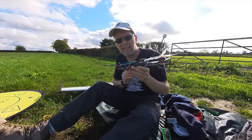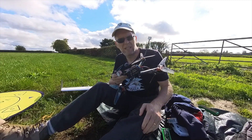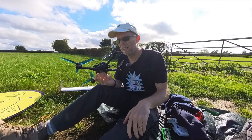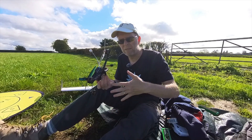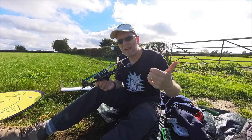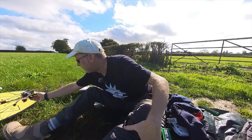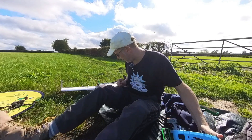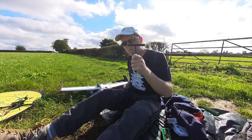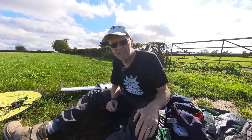This is a little 7-inch quad that I recently put the AKK 5W VTX on. I flew it about a kilometre and a half, but then I had some really bad ELRS signal where it was dropping out past minus 95 dB. This is an old R9 receiver that I modified with firmware to become ELRS, but one thing I didn't have was the radio power on the OSD, so I've added that. Because you'll see this is a horizontally polarised antenna, I made sure we're going horizontal on that. And if the Nomad module gives me issues, I've also got my old Bandit module, along with the normal T antenna and a Moxon antenna, so I can try various things out. I can put these two antennas on the Nomad as well to see how that goes — that is the plan.